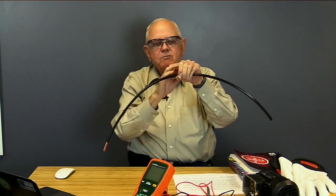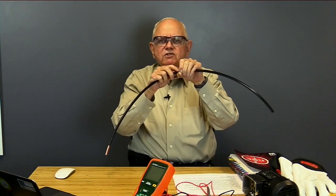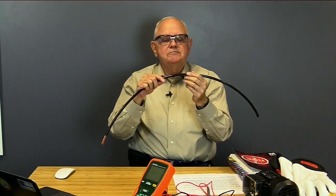Now, I don't want that for two reasons. Number one, if I have a raceway or metal enclosure or whatever it is that becomes energized, somebody could get shocked, or even worse, something terrible could happen. Not to mention, I could cause excessive heat and cause a fire. So I certainly don't want either of those to happen. That would violate the purpose of my NEC, wouldn't it?